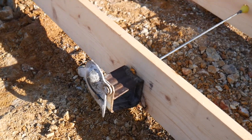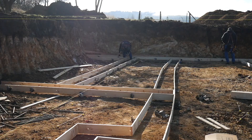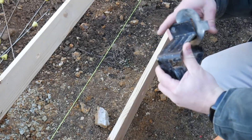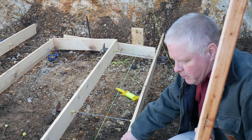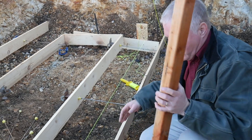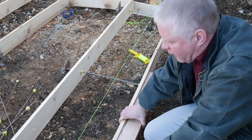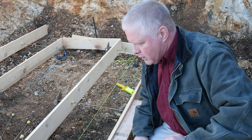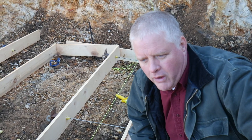These brackets are typically used for forming foundation walls. We're using them on footings — we were able to buy them in the width of the footing we're using, which is 18 inches. These brackets have a hinging on them that you can tighten, so this is going to keep our spacing at 18 inches and also keep the form from blowing out since we won't have the normal banking we'd normally put on this. A 2x4 goes in it to hold it straight, then we just level it and pour our mud extra stiff with a lot less banking than normal. I've never seen anybody do this and I think it's going to be a great time saver.